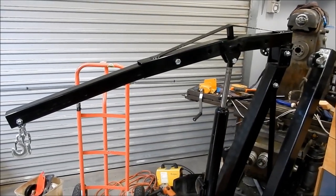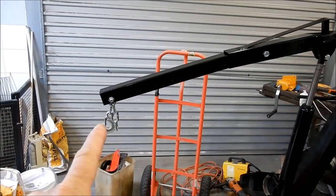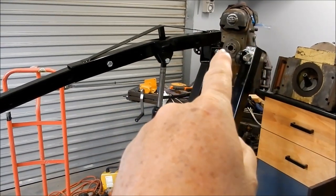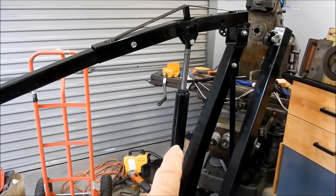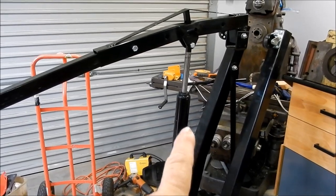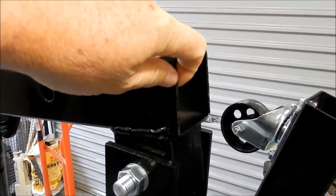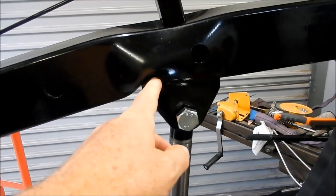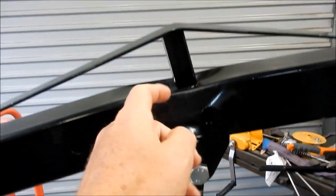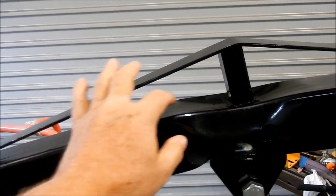Let's look at the layout of this engine crane. At the rear end we have our pivot point, we have our load point where we're applying our force, and we have our lift point where we're lifting the load. Looking at the distances, we're a little more than three-to-one. The cylinder is rated at eight ton, so we should be able to lift around about 2.5 ton at that configuration. The square hollow section thickness is about 2.5mm - paper thin - and it's an odd size at 70mm, not a standard SHS size, certainly not in Australia.